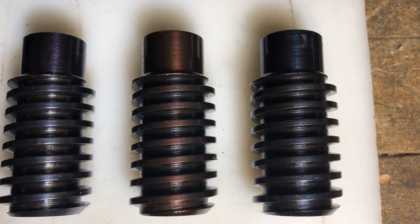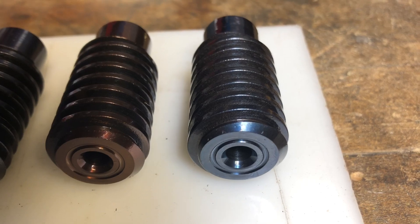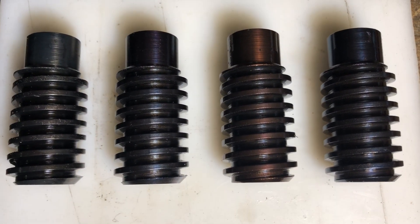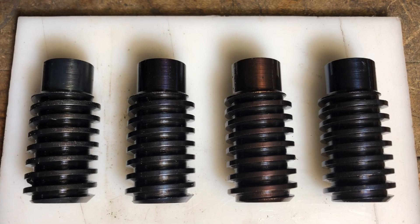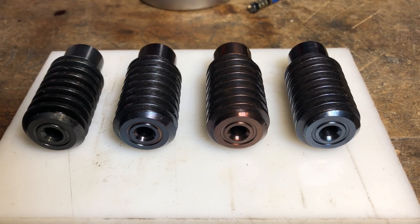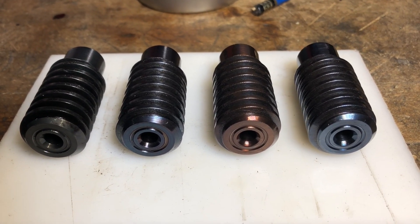The fourth part, which we stopped at blue, seems to have stepped back a little bit as well. It still has a little blue sheen to it, but there seems to be a little bit of purple poking back out. When that part goes into the oil, it must cool it down and take the color back a notch. So next time we may want to run them a little bit darker — into the next shade — to see if that brings them back to where we want them to be. Overall, the oven seems to be more consistent. All four of them look very nice and unique. I'm kind of partial to number three from the left — that bronze color is very unique and very sharp. I think I'm going to use that one for myself personally.